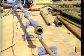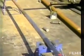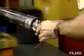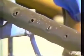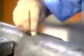The delivery system for placing the shaped charges at the proper location via wireline may be categorized as one of three possible types. Retrievable, consisting of a cylindrical hollow steel charge carrier, which is retrieved after firing and may then be discarded, as in the case of scallop guns, or reused several times, as in the case of port-plug guns.